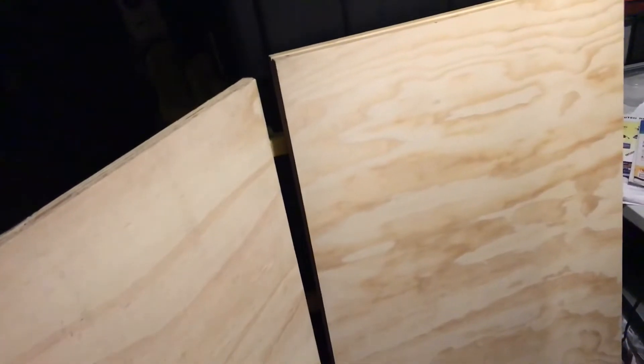I've found this to be the best way to get the plywood up into the attic and have a really good surface to crawl around on. You can put a couple of screws in it and screw it down to the two-by-fours up in the attic, and it makes for a really neat platform.